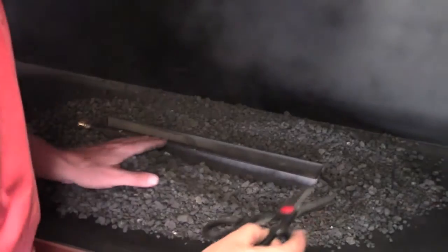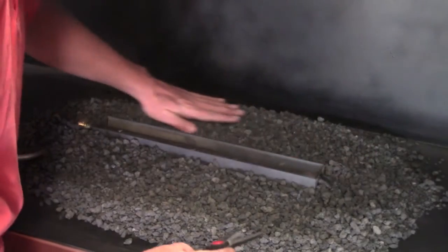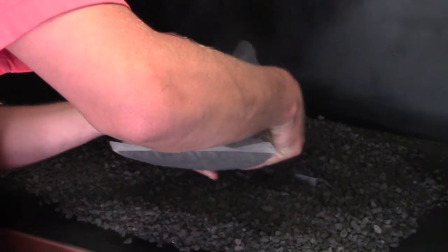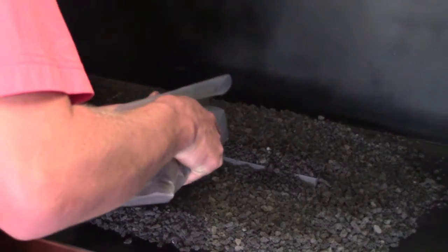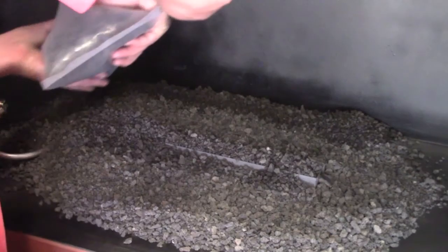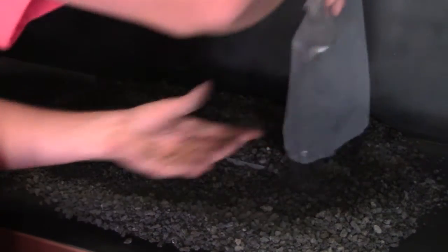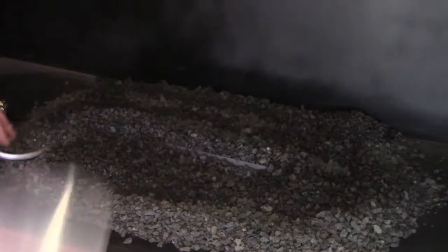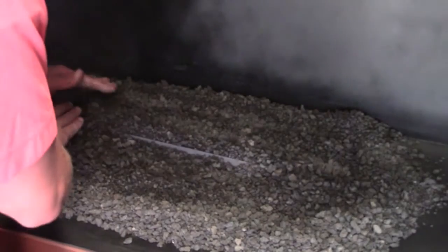Level out the surface and cover components like the aluminum connector. Fill the HD burner with lava rock — fill partially if you want to top it off with glass, or fill completely to leave an exposed line of lava rock. Though unnecessary, leaving the line of lava rock exposed might be preferable to avoid soot accumulation on the glass at the flame location.